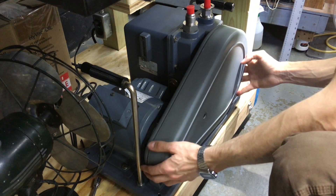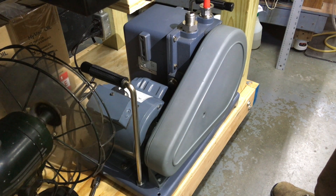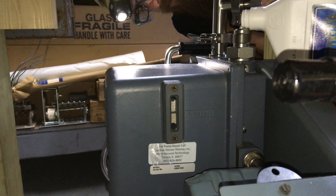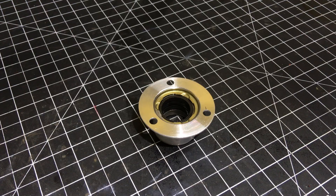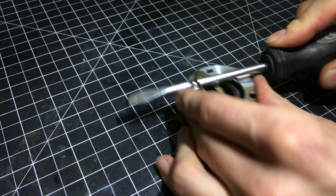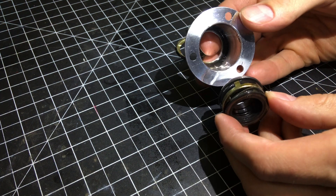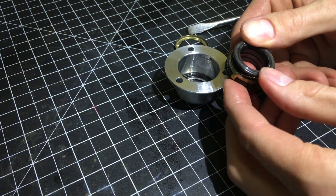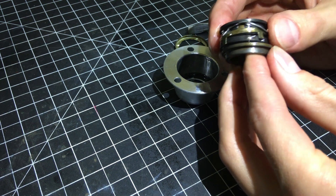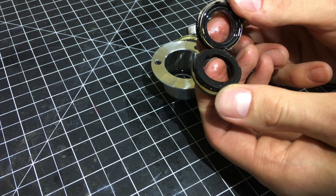I plugged the pump in and started it up to test, and as you can see, it still displaces plenty of volume. I knew I wore those safety goggles for some reason. At this point, the seal replacement was complete, and after reconnecting the pump, I topped off the oil through the exhaust port. Afterwards, to satiate my curiosity, I decided to dissect the old seal to see what exactly was mechanical about it. It seems that it has something to do with the spring tension pushing on the soft rubber seals. Some of the other rings inside were hard and dark gray, and I felt like they may have been graphite, but I have no qualitative evidence to prove it. There was definitely a lot of metal dust inside, so it was good that I replaced the seal before the failure became more catastrophic.